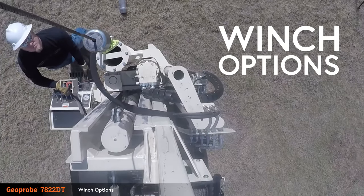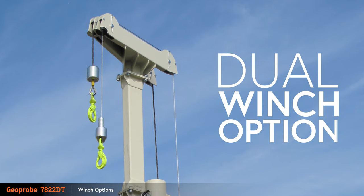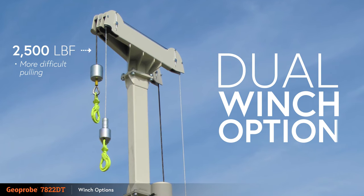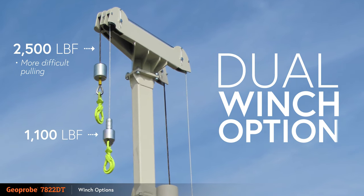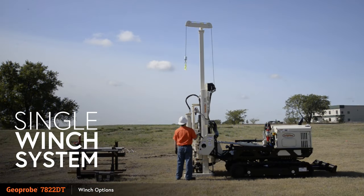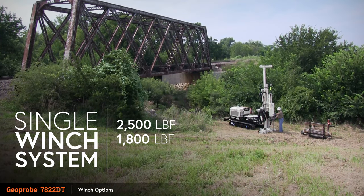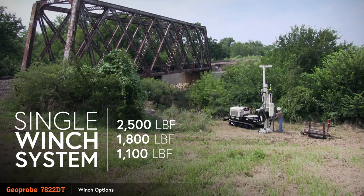The Geoprobe 7822DT has several winch options to meet the needs of your field applications. A dual winch option is available that is typically configured with a 2,500-pound winch for the more difficult pulling and an 1,100-pound winch for the faster, deeper wireline work. A single winch system is available as well. Options for this include 2,500-pound, 1,800-pound, and 1,100-pound winches.